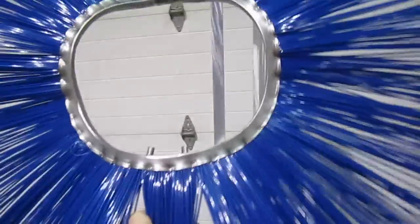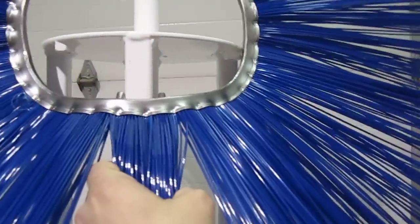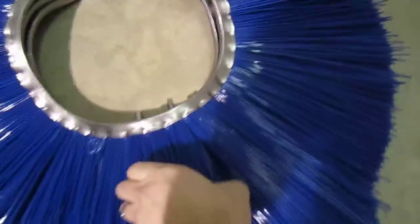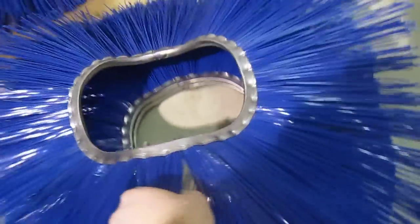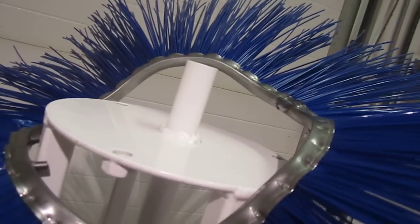Come over and grab a convoluted wafer and make sure you get these pins around the bar on the arbor. Go ahead and set that on there. Grab your next convoluted wafer, rotate it 90 degrees to where the last one was installed, and install that.